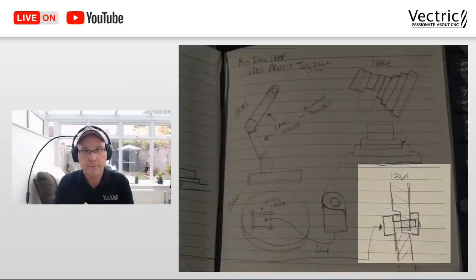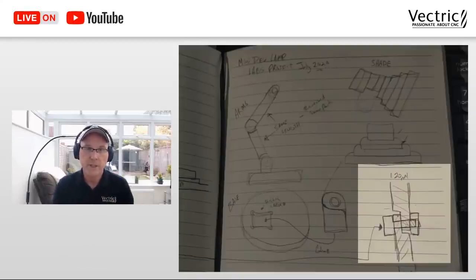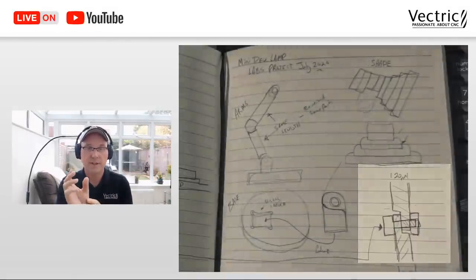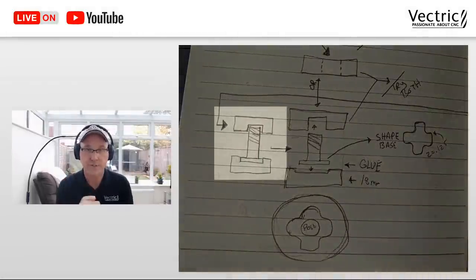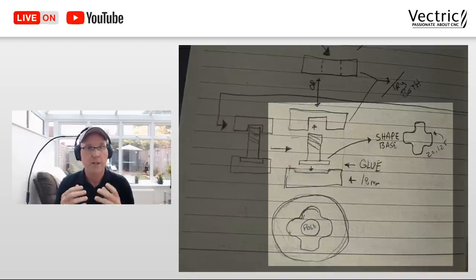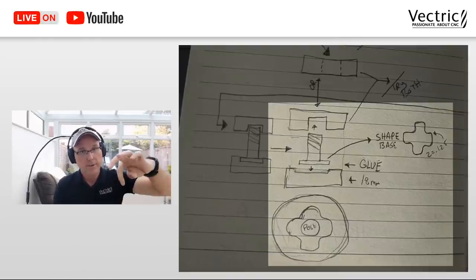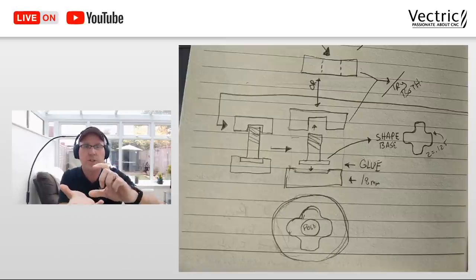And this is the tricky bit, coming up with a way to use thread milling to hold together the armature at the joints. Now, I knew that my material thickness, I needed the nut or the post, the threaded post, to be longer than my total thickness of material. In order to do that, I needed to have a three-part assembly for my post and the nuts. So here you go, right here. You can see the top of that drawing is the actual nut that twists on to the threaded post. The post is going to be made out of a different material than the nuts, or the post cap, we'll call it, that goes on the bottom of the post.